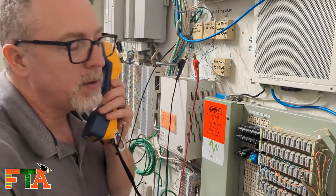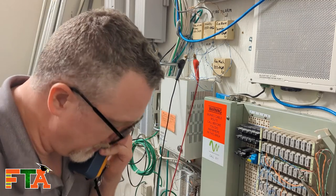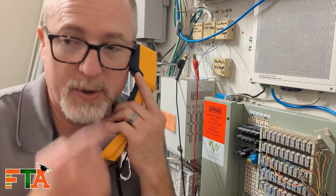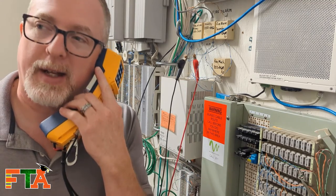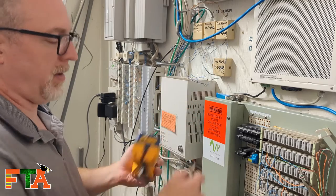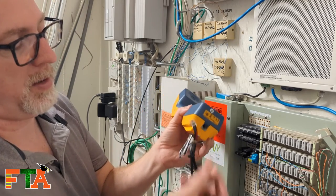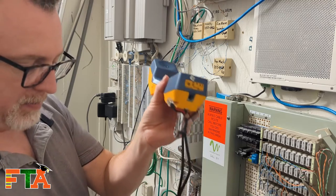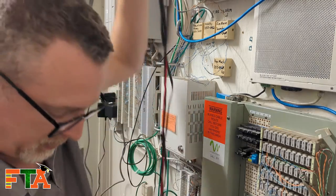I should be able to go to dial tone. I have dial tone. So now the next question is, can I dial out? And you're always listening — if you straight dial and it doesn't go, then you might have to dial 9 to get out, different things like that. So I could, theoretically, plug my butt set — and to show you this, instead of using my alligator clips, I can use the regular RJ11 on one end.